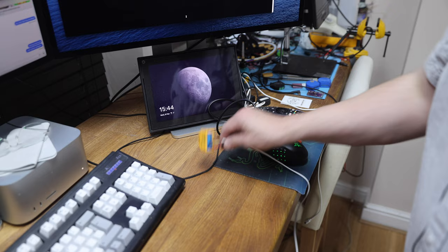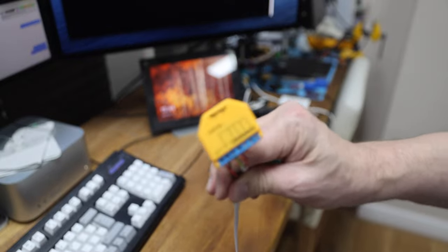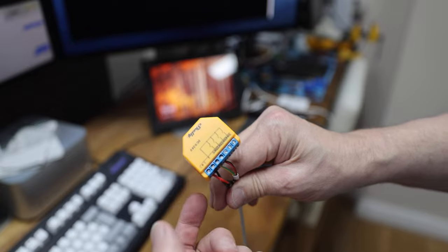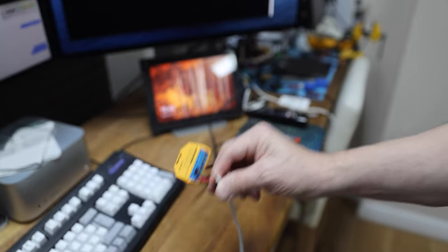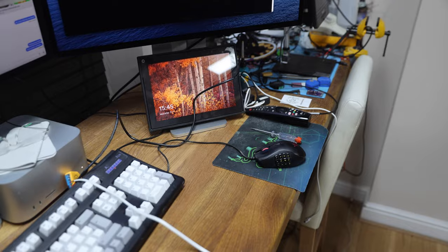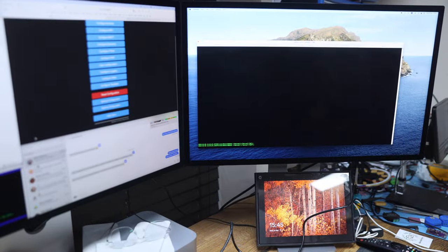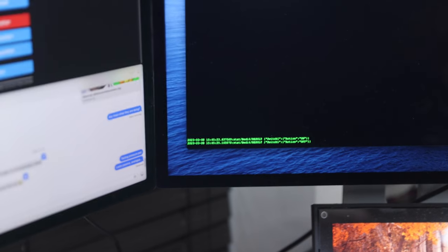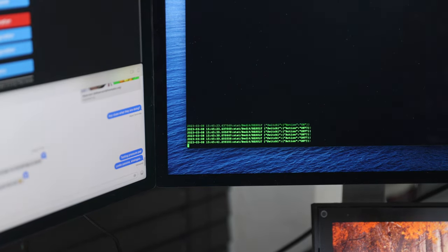The next question is, can I use it with the i4? I've got my i4 here, plugged into a USB lead. You've got USB lead on — plus and minus — but it says T, that's earth. I've then got the two leads at each end. I know it's not very tidy; I will put some bootlace ferrules on later. If I step on the mat, which is on the floor here, and step off — then as expected we see: step on the mat, step off the mat, step on, step off. I'm actually using Tasmota here, not Shelly, but Shelly would work in exactly the same way — it would see that as a switch. That's about as simple as it gets.